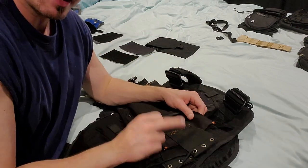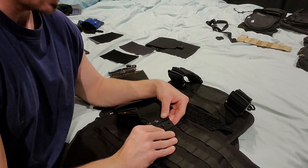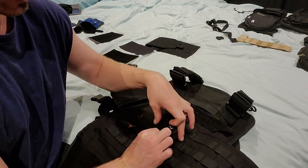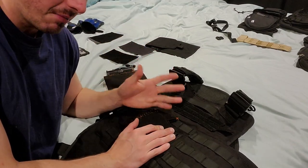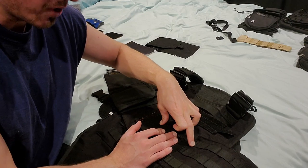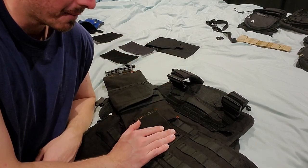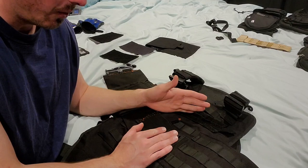That's my next step — from where I am right now, measure how much stretch this has. I'll attach these two as tight as I can at this point, so I know my full tightness with these two joined together. Actually, if I do it separate like this, measure the stretch from the side of the carrier to the tip here — I'll know exactly my max amount of stretch between the two things. And then by attaching these two, put the carrier on, measure how much slack — that part is going to be really tricky doing solo, I might have to get a hand to do that. But I can see how much tighter I need the thing. Once I know how much stretch I can get on both sides, I can subtract what I need to make it tighter, and probably add two or three inches so I can make it even more tight and give a little room of play.